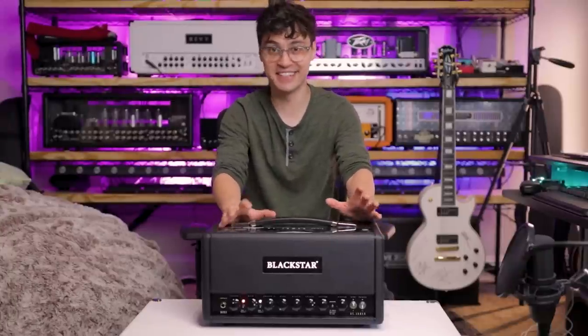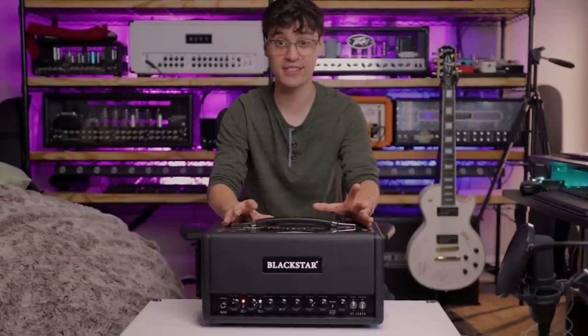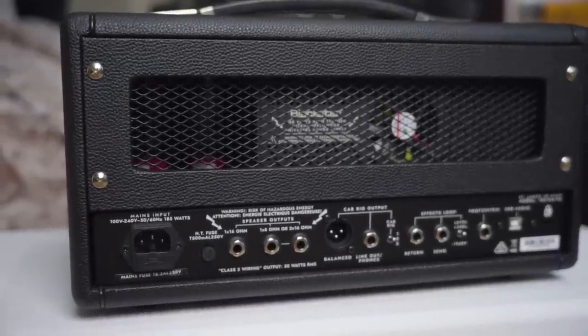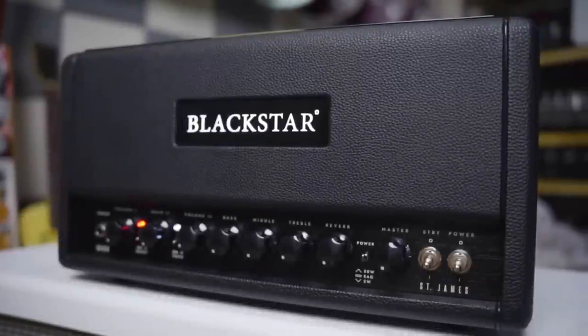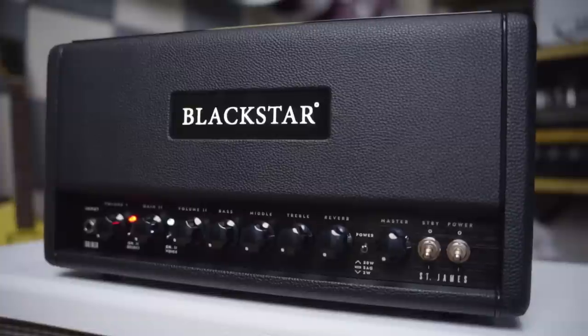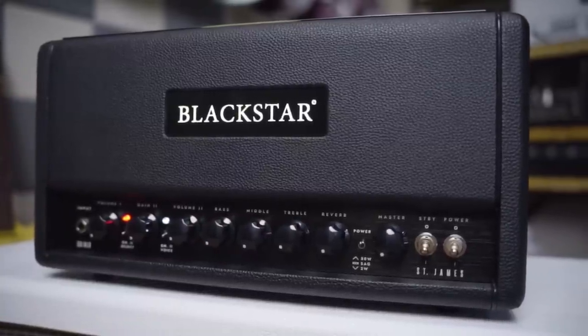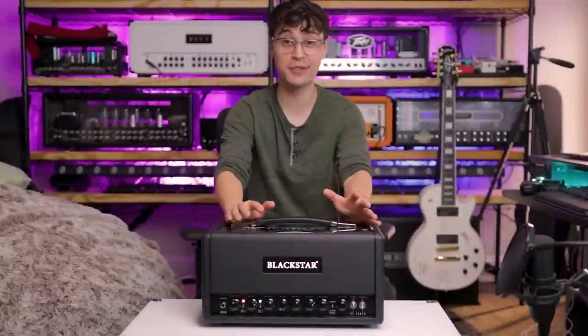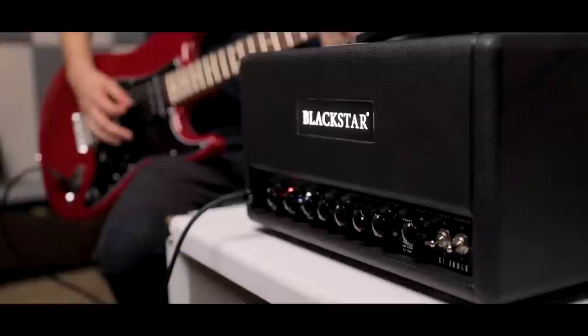And one of the key things they did is replace the transformers. Not with Decepticons for anyone concerned, but instead with a 400 volt switched mode power supply. And you don't really need to know what that is. All you need to know is it means this amp basically functions like you'd expect any normal modern electronic appliance to. It takes voltages from 100 to 240, so you can plug it in at any of your world tour dates without issue.